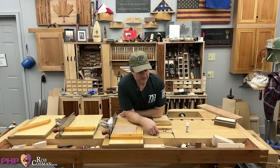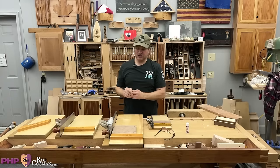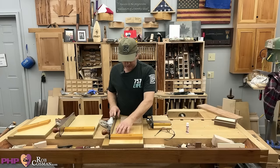Next, Frick. Anthony Steventon in the chat says, should I use the same shooting board with a 45 degree and 90 on the same board or separate boards? Oh, well, some people make an attachment. In other words, you would take a regular shooting board and put in an attachment, which turns it into a 45.